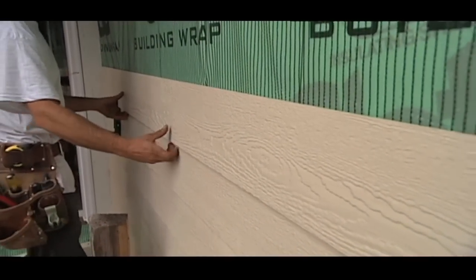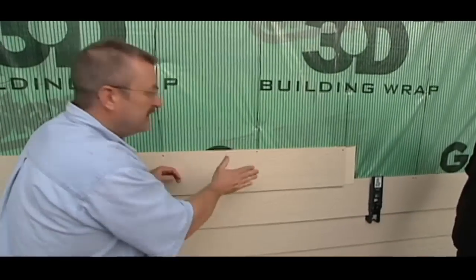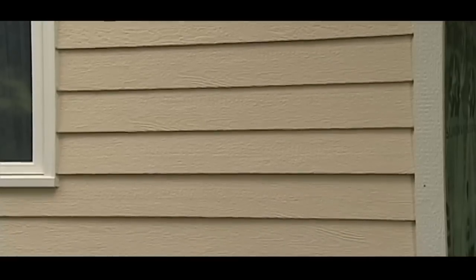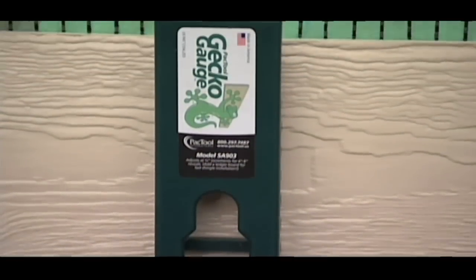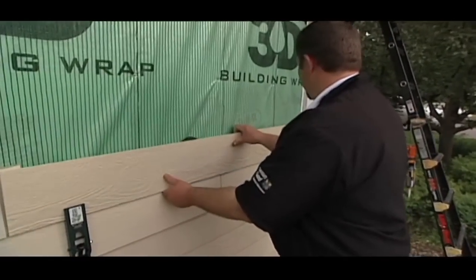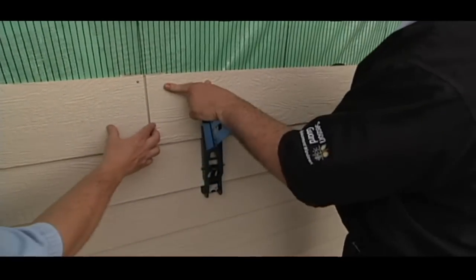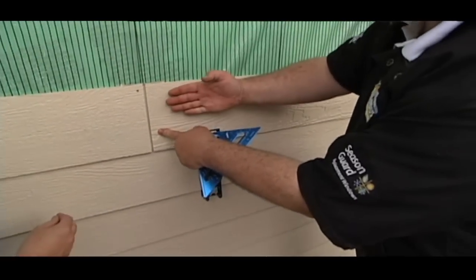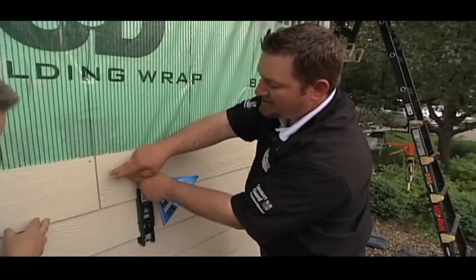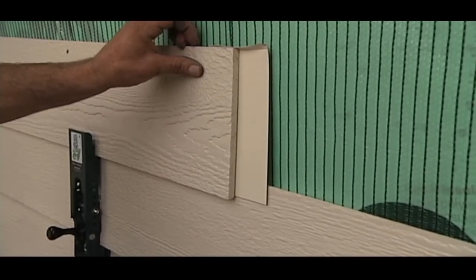It gives a very nice, clean appearance — you don't have to worry about any touch-up. The term is metamerism if you come and touch it up; the sheen is just a little bit different and you want to avoid that as a homeowner. For a finished product, you want everything uniform and matching. These little tools give us the proper reveal on our siding — a normal speed square gets our spacing system in there. With the LP, over time it will swell and won't contract, so seams will close up. What's different about our installation is our slip sheet is actually a piece of color-matched aluminum, so it really does blend in when you stand back and look at the wall.